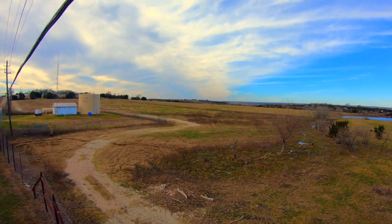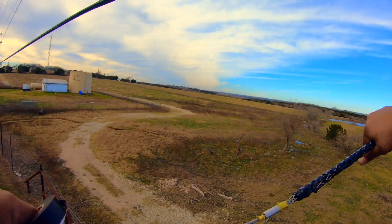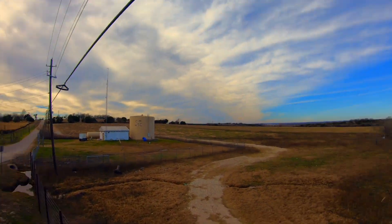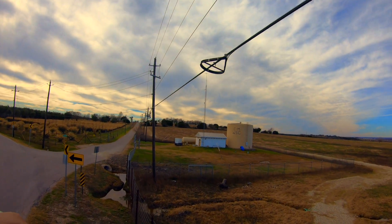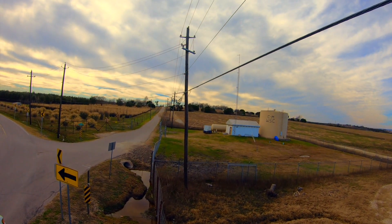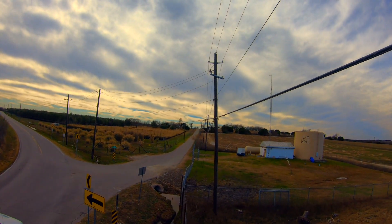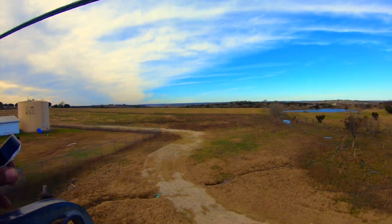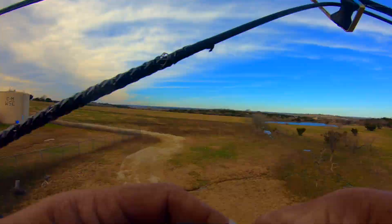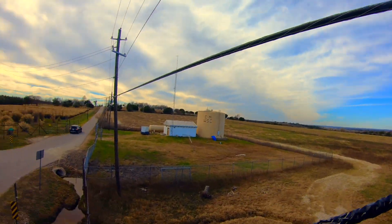You want to bypass those snowshoes and storage loops — put a roller either before or after those things. This is the 90-degree turn I'm talking about. You want to go into it nice and smooth. That's why I set everything up the way I did — rollers placed for a reason so it pulls nice and smooth. I'm out about a thousand feet or so.